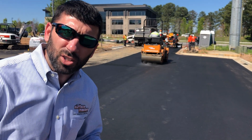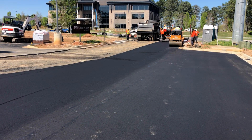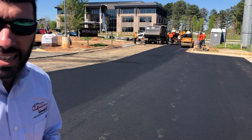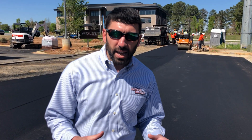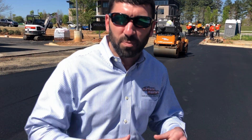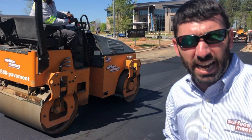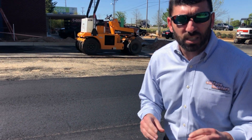You can see the weight is distributed on two steel wheel drums. As he's making his way back, you may hear him cut the vibrator on, and what that does is allow for additional or maximum compaction. Sometimes specs ask for 95% or 97% compaction rates. This roller gets the initial compaction — compacted to 95% — which means pushing 95% of the air out of the asphalt and leaving about 5% air in. The reason you want a little bit of air in the asphalt is for flexibility, since asphalt is naturally flexible and you want it to remain that way for a long-lasting parking lot.